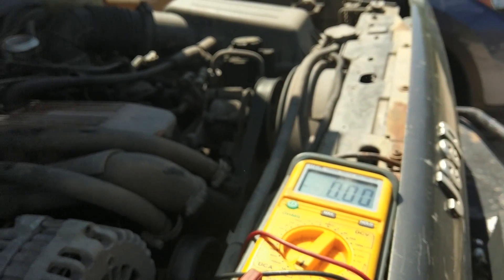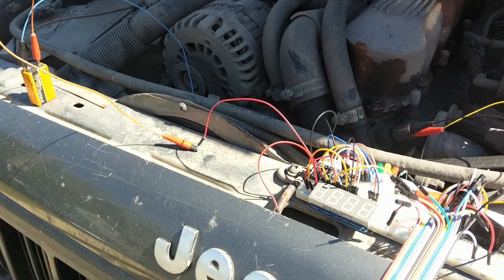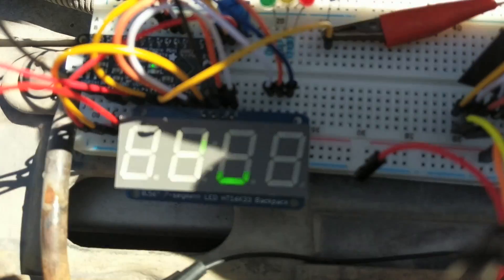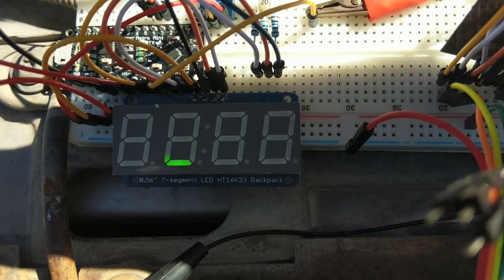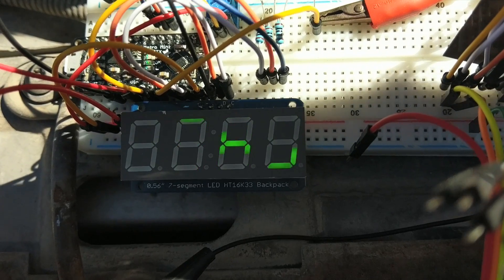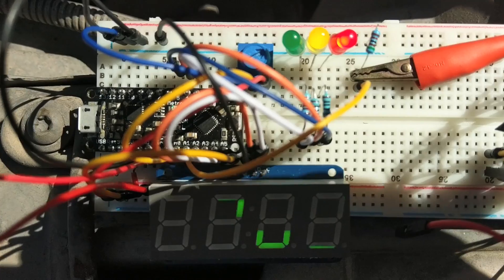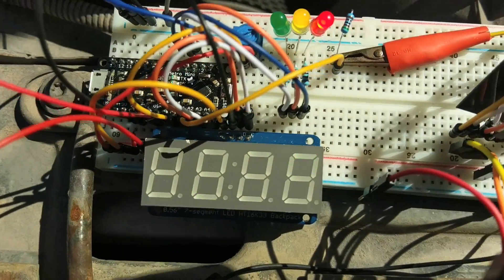Now we can take our wires and figure them all out. Take a look at this jumbled mess - we've got the Arduino powered off a 9-volt battery just for testing, and we've got some alligator clips up on the sensor. The phone actually picks up the flickering - persistence of vision. That says 263, which is the raw analog value we're receiving.